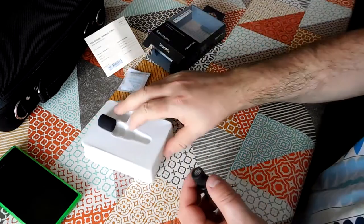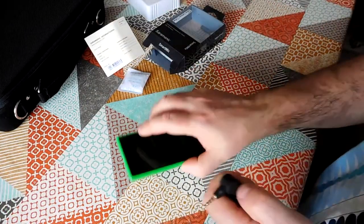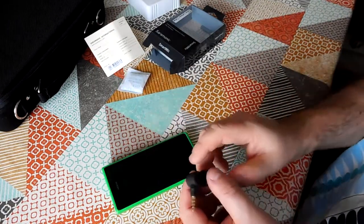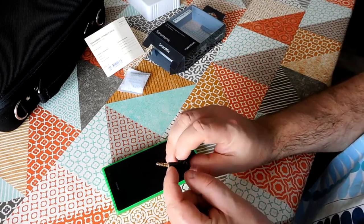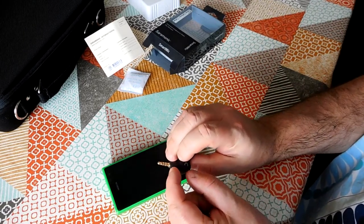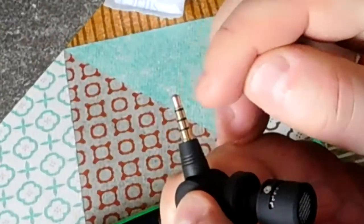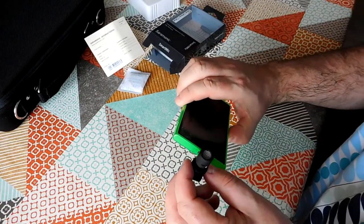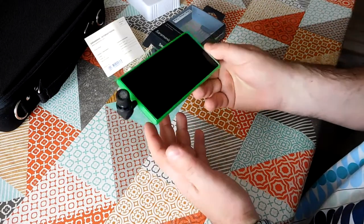The first thing to do is to test this with my phone. In order to get a microphone working with a phone jack, the phone obviously has to support an external mic, and in most cases when they do, they need one like this which has four conductors on the 3.5mm jack plug — what they call TRRS: tip, ring, ring, sleeve. It plugs in very nicely and seems to work quite well.